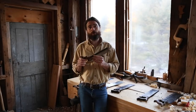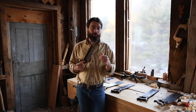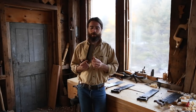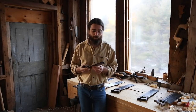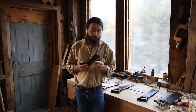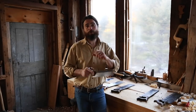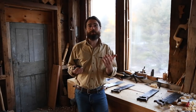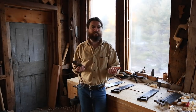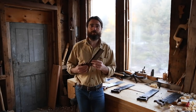When I compare my dovetail saw kerfs to historic ones, the historic ones are often narrower than mine. So it's important that a dovetail saw is quite thin with not a lot of set, because it's really supposed to do very fine work. I also use my dovetail saw for very small cross-cutting tasks — like cutting a protruding pin flush — and even though it's rip-filed, the fine teeth make it work well.